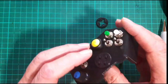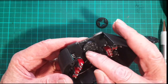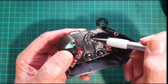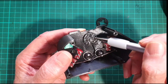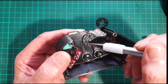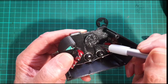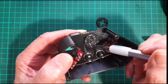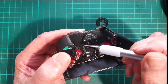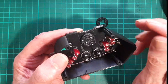You'll notice on the inside that you've got the switch connections come through. The ones in the center are designed to come together and just be linked up with a little bit of solder on those four points, and then from one of those take your common. Then the other pin on each of the other two — so there'll be one, two, three, and four — would become your connections for your switches themselves.